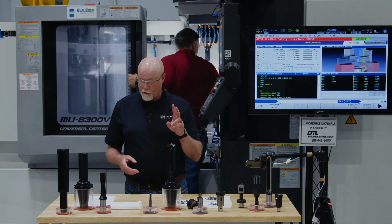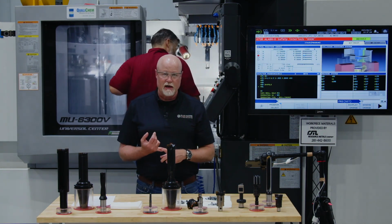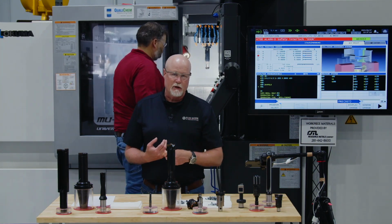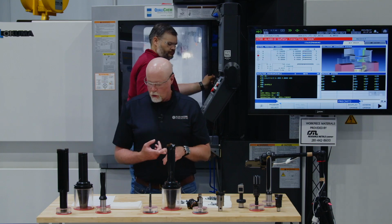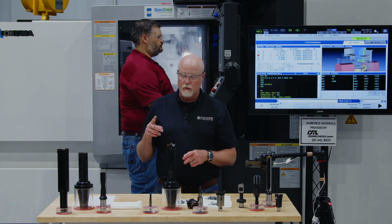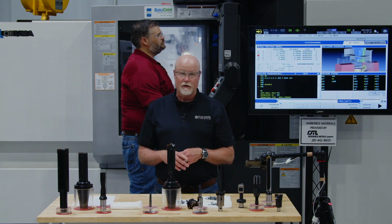So that was hole profile number 2. We took a 2-inch diameter revolution drill and opened it up to 2 1/4 inch diameter using a Combi-Line tool. For hole profile number 3, we're going to use our APX tool to create a 2-inch diameter hole going 5 inches deep.